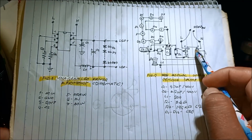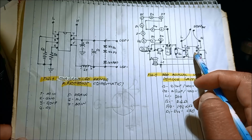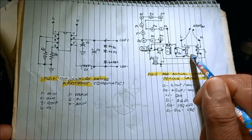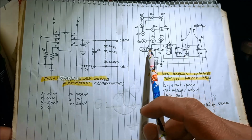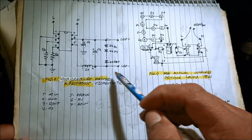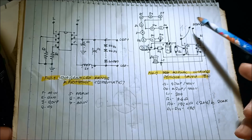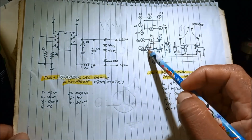So as we can see here, there is no full bridge rectifier or any rectifier used, but this IC, there is a rectifier inside this IC. So that's why we just use an IC instead of a diode or any other kind of rectifier to convert alternating current. This is AC, and then will become DC here. The output now, what is now the output? DC output, high voltage DC. So making this LED, all in all, we have this 18 watts of power.